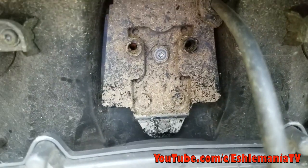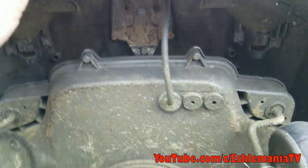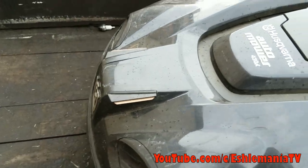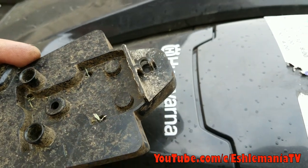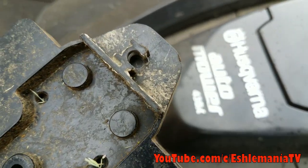It won't let it run — it thinks it was in some kind of a collision — so you get the fault code we saw at the beginning. I'll show you one of these with the magnet missing. This is what it looks like: just completely open air in the front. Sometimes the magnet gets broken, sometimes it just falls out if the mower hits something too hard.